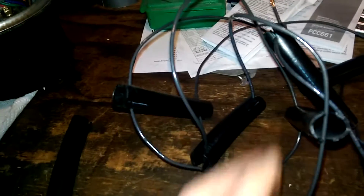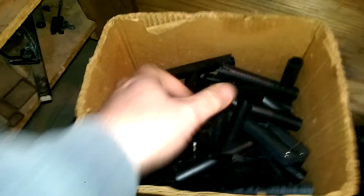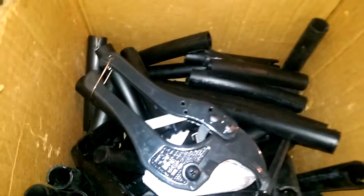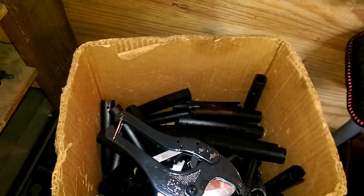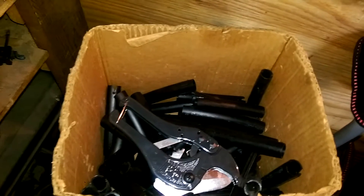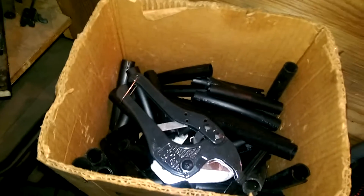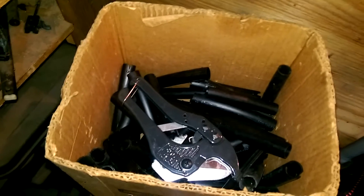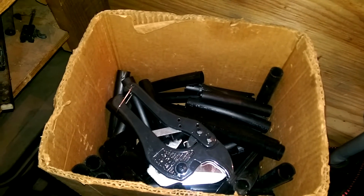That's what I've got feeding both of the units outside. I'm going to build another one — pretty fun stuff. These little cutters are available commercially to cut that sprinkler pipe, but you don't necessarily need those. I highly recommend this antenna — if there's one antenna I could have, it would be this one. The better performer is probably the 40-meter extended double Zepp, which is about 87 feet per leg, or roughly 170-something feet across. I have it bent down 25 feet on each end.